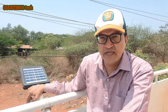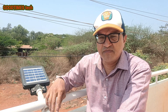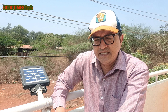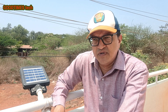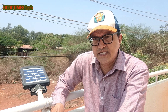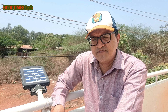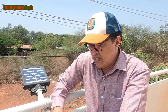If there is a tree beside the light — as you can see there's one behind me — when wind blows and tree branches move, the motion sensor triggers and the light turns on. This reduces the battery backup. If the wind blows continuously, the light will not switch off. So mount the light in a place with minimal unwanted movement from trees or objects. Once triggered, the light stays on for a few seconds then dims down to 10% brightness until the next motion is detected.